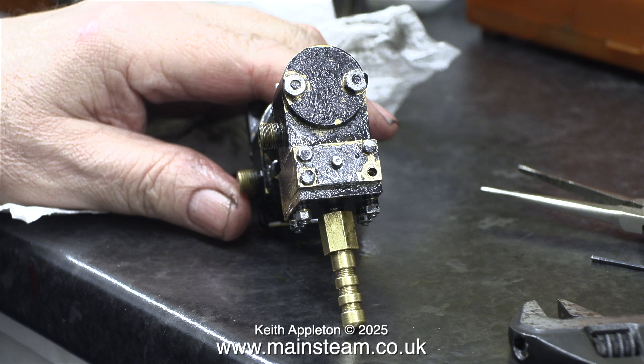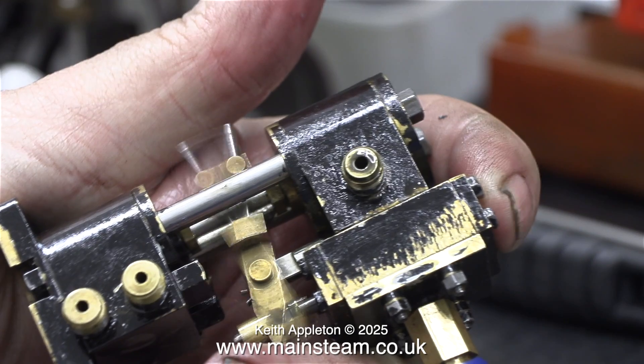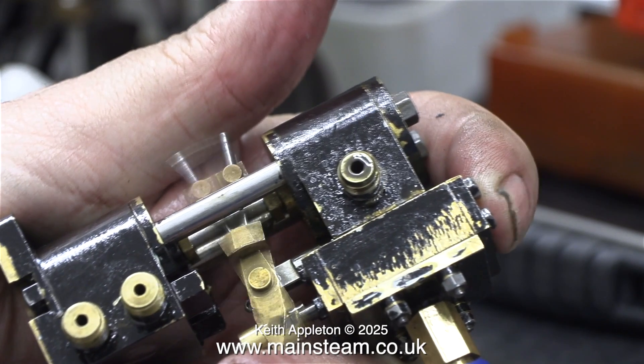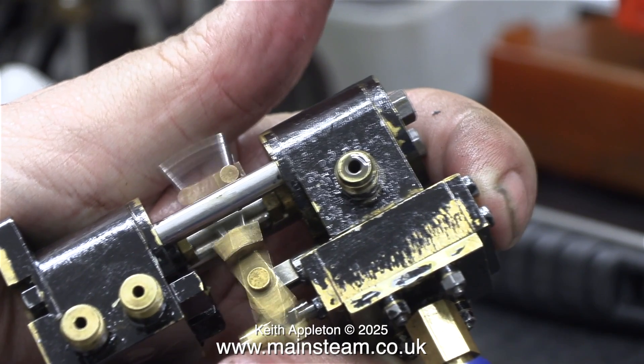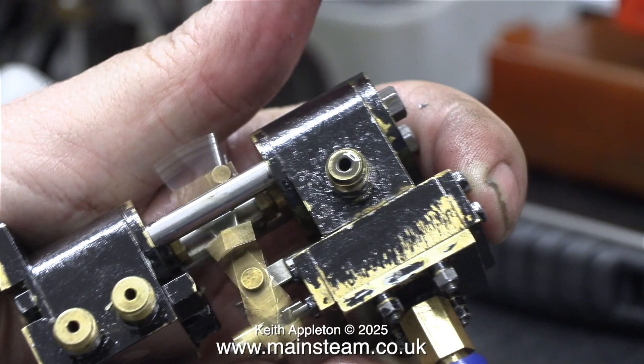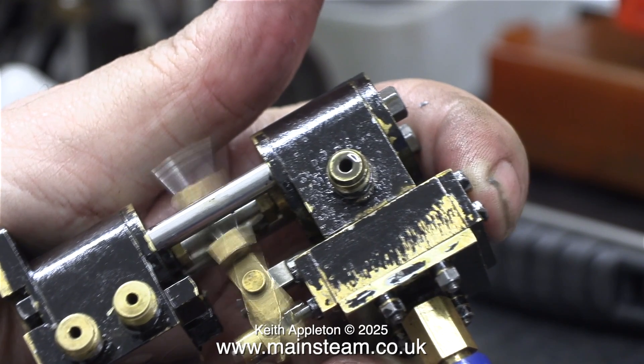Here's a close look at the top part of the valve — the bolt is still missing. But look at the 4BA nut on the top right; I've turned the pump over now so it's on the left, but it's really beaten up. It is not a good idea to use excessive force on any of the components of such a finely made and very small pump. I replaced both of these 4BA nuts with brand new ones and apart from looking better they're holding the cylinder a little more securely. But even in slow motion you can see I still have to have my finger over the end of the valve shaft.